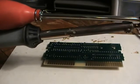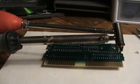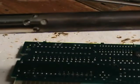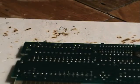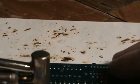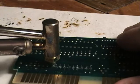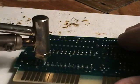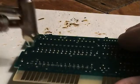I usually buy like 10 at a time or more because I do so much of this now. I like to use fresh tips as much as possible. If I can use one tip for like four or five boards or even less, I'll do it because I'd rather have good tips and have the board nicely and cleanly desoldered, as opposed to having to fight it. The worse it gets, you have to sit there and fight it, doing it over and over again, getting solder all over the place. It's better to just keep it nice and clean like what I'm doing now.